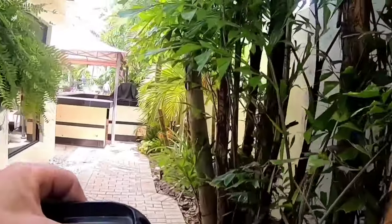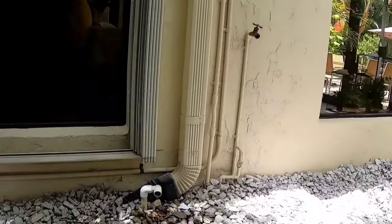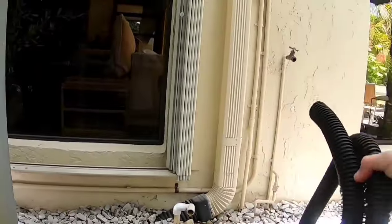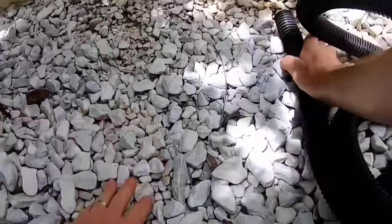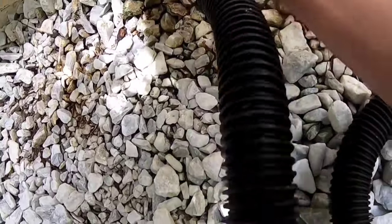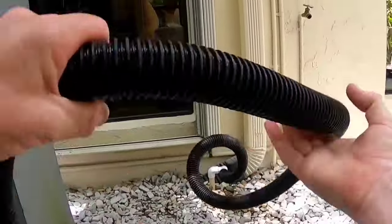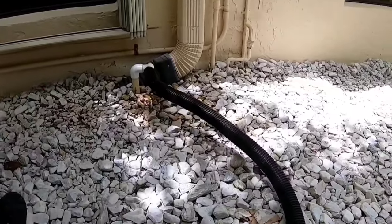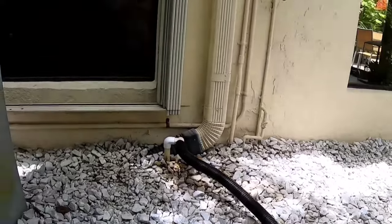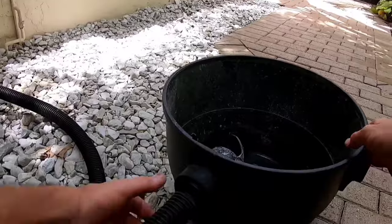The first thing you want to do when trying to clear your drain line using a shop vac is determine the outlet to the drain line. Next, you're going to want to connect your shop vac hose to the outlet of the drain line snugly and firmly so as to create a good seal. Connect your hose to your shop vac. If your shop vac has a larger diameter hose, you might need to find a way to reduce the diameter so it still fits snugly over the drain line.